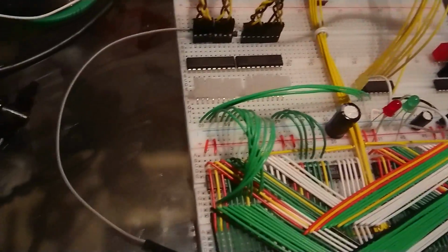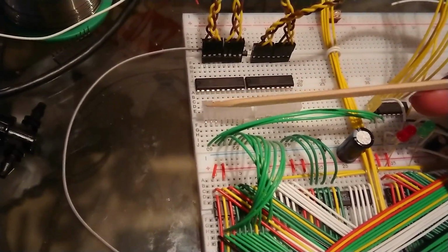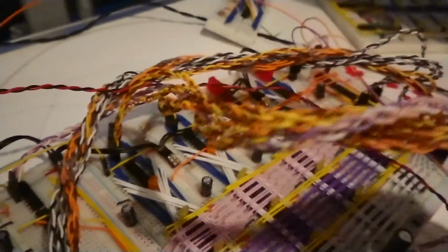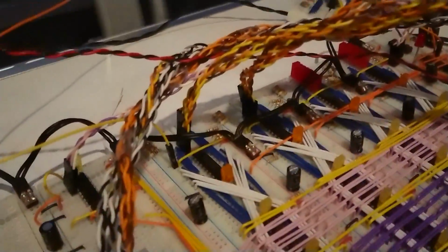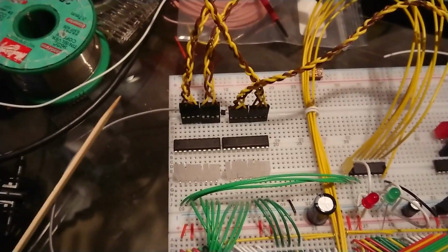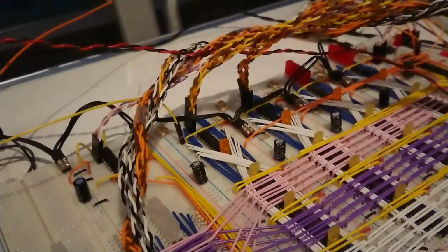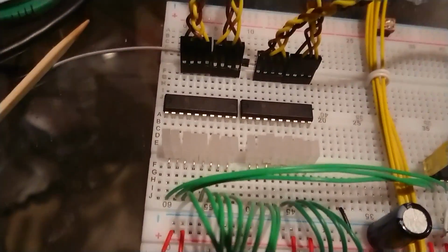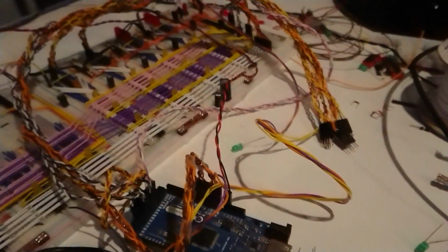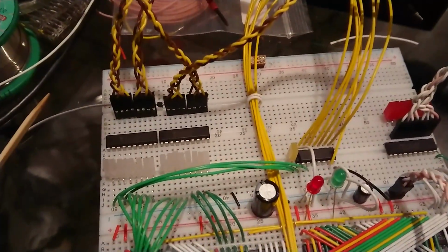So yeah, I'm thinking of using them here as well, just because once I was using those two registers as the memory address register, as you can see, I've got these additional wires that I've made, and they just jump in there, and that works fine, except I had to remove the LEDs from one of the sides, because you could tell that the current draw was getting high; they were just getting dimmer and they weren't working so well. I suppose it was the combination of red LEDs and green ones paralleled up to each other. So again, it would be quite nice to use the buffers just to isolate the modules from each other a little bit. So I'm having a play with that at the moment, and desperately umming and ahhing over chip placement